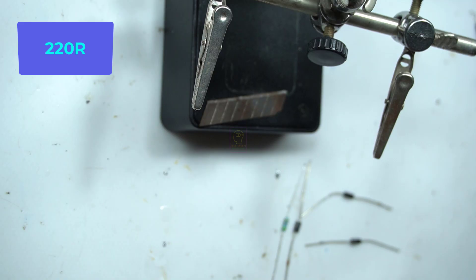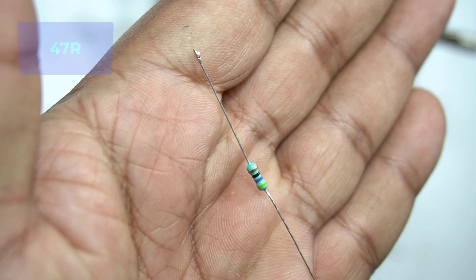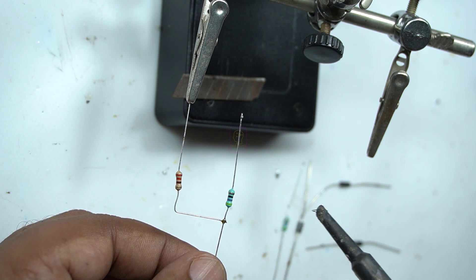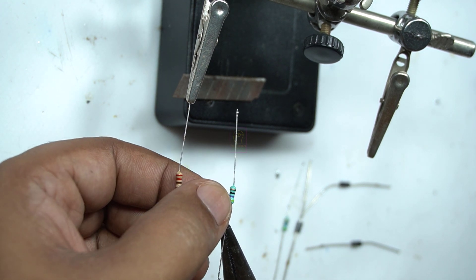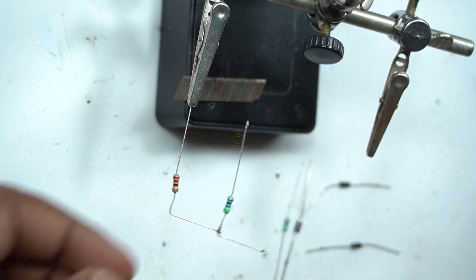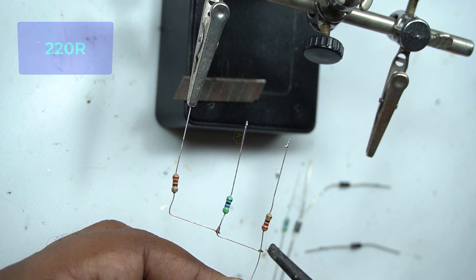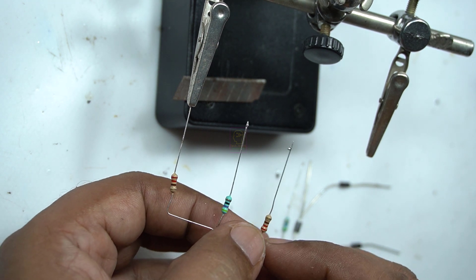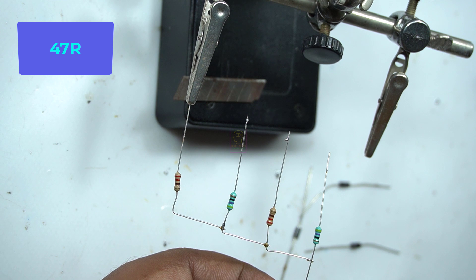Welcome to the new episode of Tech Insert. We are going to assemble a cheap, efficient, more accurate 3.7 volt lithium-ion battery charge level indicator system. We are coming up with a four-level indicator system — it uses four resistors, four diodes, and four LEDs for its operation. You can change the resistor value and use this for any batteries. The technique uses a voltage dropper system: 1N4007 diodes have 0.7 volt drops at the PN junction. This works on silicon diodes only — if you are using germanium diodes, please change the resistor value. The complete circuit diagram is also added in this video.